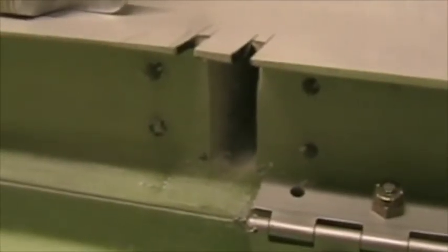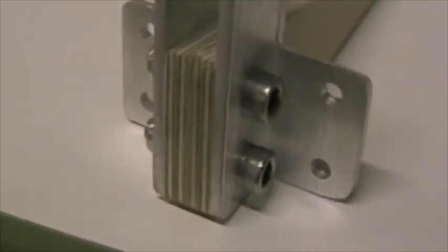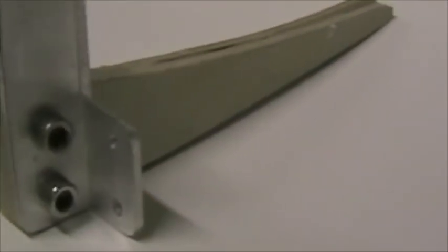Then I'm ready to insert the aileron horn. There's the cutout in the aileron. There's the horn itself. Two angle brackets attached to two pieces of 6.5mm plywood. And the shape of that plywood is taken off template number 4, wing template number 4. This is the Express, so the aileron is at station 4.